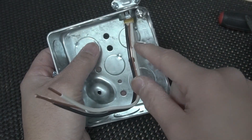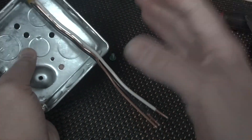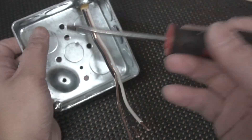The next mistake is the amount of wiring inside the box. This applies to any type of electrical box — metal or plastic, old work or new work. Per code, the minimum amount of wire from the end of the sheathing is six inches: three inches from where the wire breaks the plane of the box edge, plus an additional three inches past the edge, totaling six inches. Some people only leave around three inches. I personally like to keep around eight inches so the next person or DIYer has plenty to work with in case they need to change out the box.